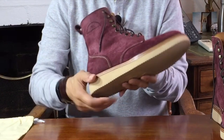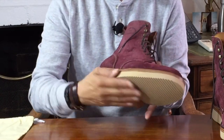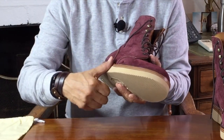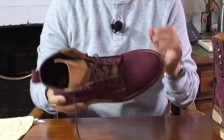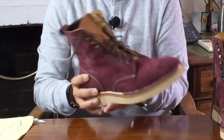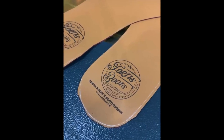Take a look at the edges. Most handmade bootmakers — even those PNW bootmakers — will glue the sole on and then sand the edges on a sanding wheel to trim them. These guys shave the edges; they use a sharp knife, and smooth as a baby's bottom. Inside the boot is a veg-tanned leather filler that fills the cavity caused by the welt. More often than not in other boots you'll see a cork cavity filler, except in many PNW boots where they use veg-tanned leather just like the Strider. A steel shank is embedded into the leather midsole filler to give arch support and longitudinal stability. On top of that is a veg-tanned insole to which the welt is attached, and on top of that is a comfort leather sock liner insole with a pretty cool print on it.